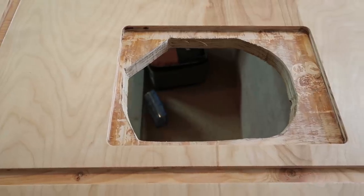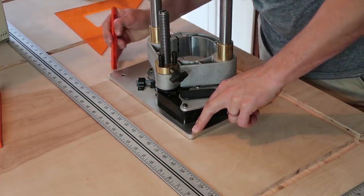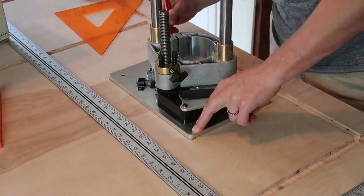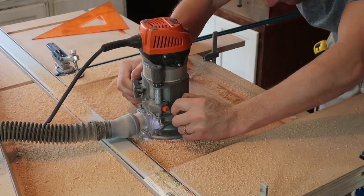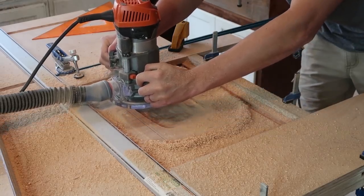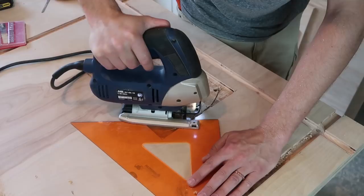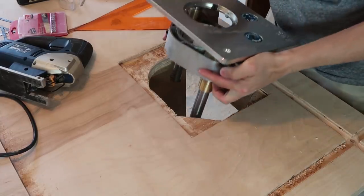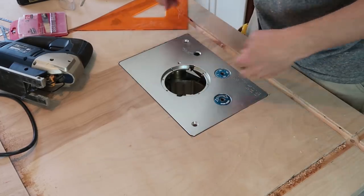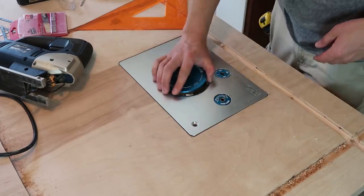Now that the T-tracks are installed, I'm going to work over at the router lift station and cut out the area where the router lift will be set inside the top of the table. I used the Pro Lift as an outline, flipped it upside down, and traced it onto the table. Once traced, I clamped four boards around the perimeter — two and five-eighths offset from the hole I wanted to route out — so I could use them as bumpers and route out the entire inside. Then I cut the next level, leaving at least a quarter inch around the perimeter for the plate to sit on, and cut out the shape inside so the Pro Lift fits right down inside and hangs underneath the table. For more detailed instructions on how I installed this router lift, check the description for a link to the blog post.